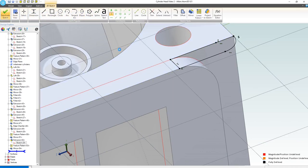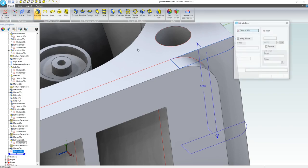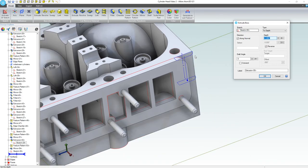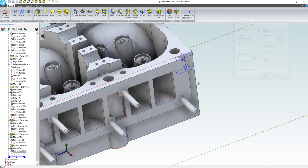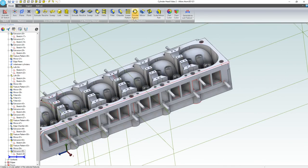We're going to deactivate. And I can go with extrude. 1.35 isn't bad, actually. I want to go a little bit deeper on that, but let's go with something like 0.75. And in the wrong direction, of course, because what would happen if I did it in the correct direction? So we're going to say reverse. It's always those negative signs, right? I fill in those negative signs and don't know what I'm doing.